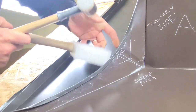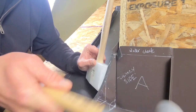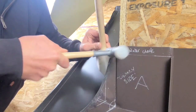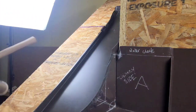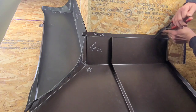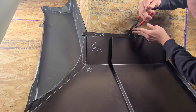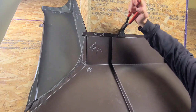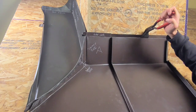I'm getting the finishing touches on this double seam sweep. I'm just dressing in the top side of this seam — it's coming together nicely, right on that corner. Angles are looking good. You guys, take time on forming these pieces, get the right tools, and your end result will really come together. Your folds are nice and crisp.